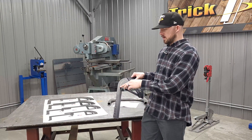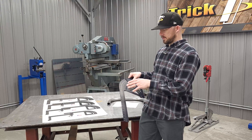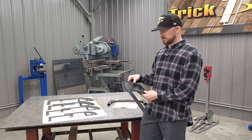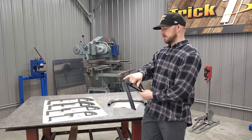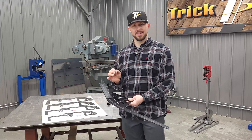It does have inches of material marked on here. This is all based off of the centerline of your tube — the outside edge of the bend protractor is the centerline of your bend.